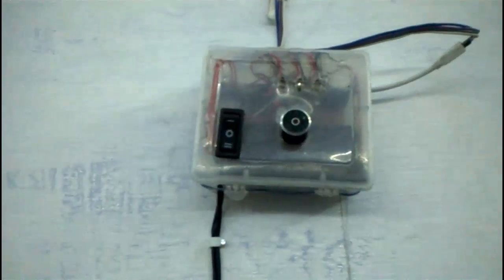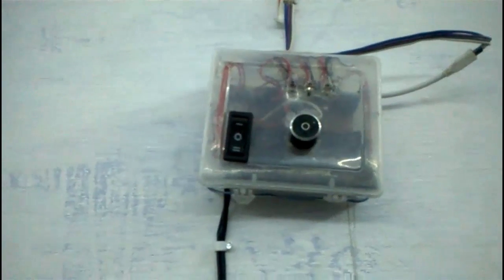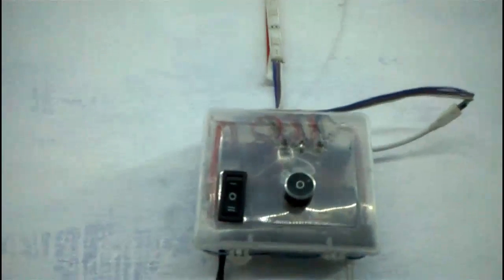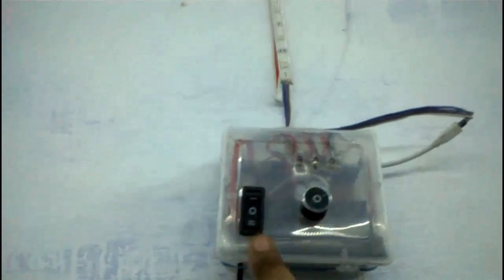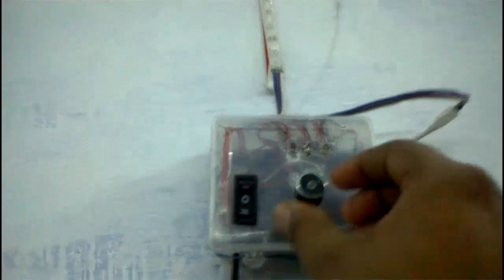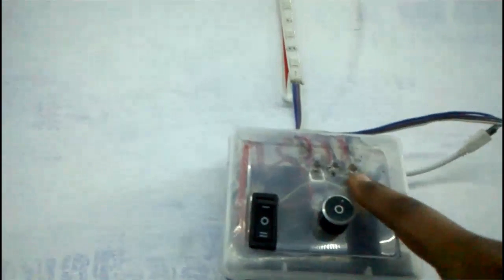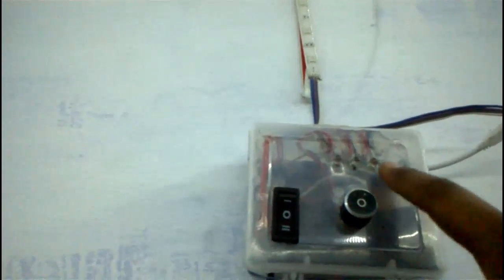It's a very simple circuit and doesn't require any kind of microcontroller. I have used an N-channel MOSFET. This is the power button. This is the 50k pot to adjust the brightness of the LED. These are the three LEDs — red, green, and blue. Red is for low frequency, green is for mid, and blue for high frequency.